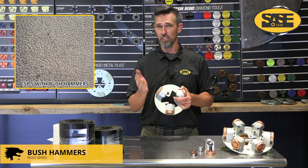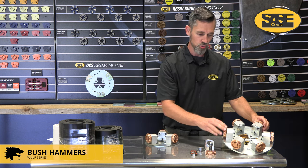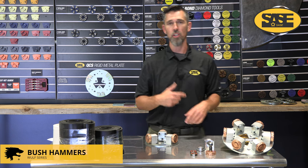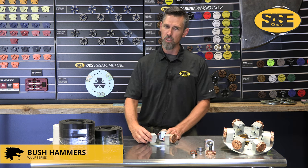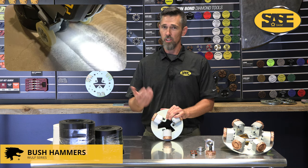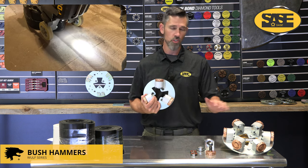These are ideal for surface prep targeting a CSP of around four to six. Under a SASE grinder you can achieve closer to a CSP of four or five with six tools on the machine running faster with counterbalance weights, or slow it down RPM-wise and add head pressure weights. You can also take three opposing tools off and leave just three per plate for a deeper, rougher profile closer to CSP 6. When it comes to coating removal, they work well on coatings already starting to fail — brittle epoxies chipping up, mortar beds, overlayments, underlayments that are failing — to pop those up and get them off the surface.